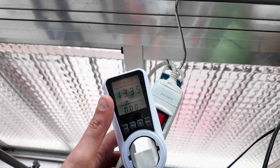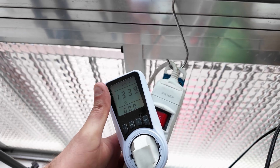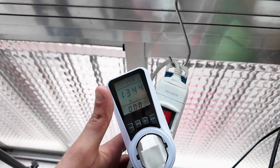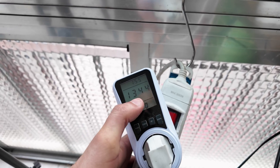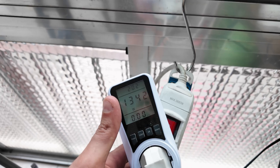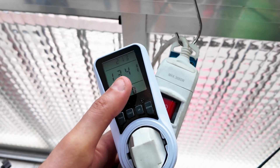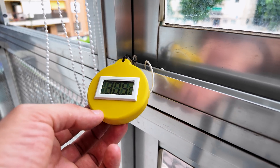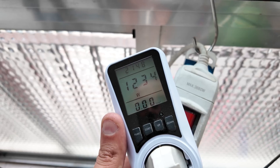I just realized it's drawing 1337 watts after almost two minutes, which suggests the melt will take a bit longer. Because I just finished an 8-hour burnout, the magnetron is still hot — normally when it's not hot it would draw 1400 watts and then drop as it gets hotter. The microwave is quite hot so the magnetron isn't working at full power, and it doesn't help that it's 30°C. After almost 22 minutes it's now at 1234 watts.